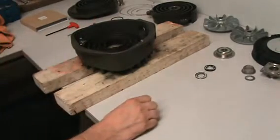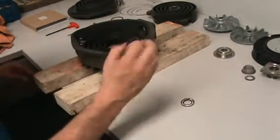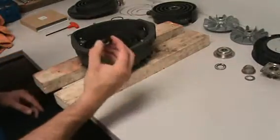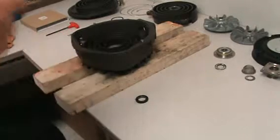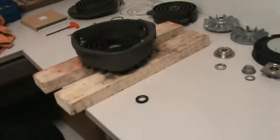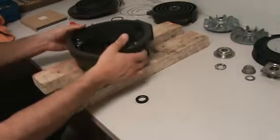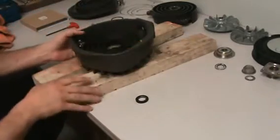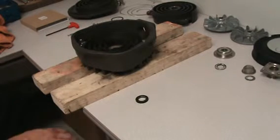So, reassembly of FS1. You're going to put the darker of the two, shaft seal one, in first. So it's taken apart. Yeah, FS1 is completely apart. The other scrolls are not. Usually I do it one scroll at a time. Sure. It's easier to disassemble one, clean it, reassemble it, move on to the next one. Right on. All right.